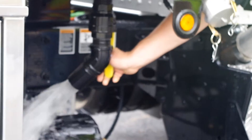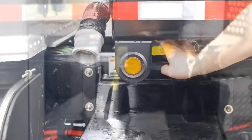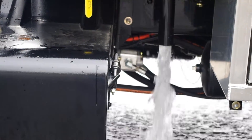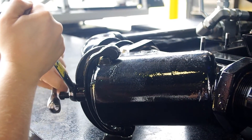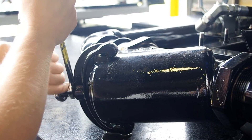To release the water out of the water tanks, locate the water tank drains on both the driver and passenger side of the truck behind the cab — usually yellow handles — and turn them down. Once the water is drained from the water tanks, leave them open and remove the cover and filter out of the Y strainer housing using the wrenches mentioned before.